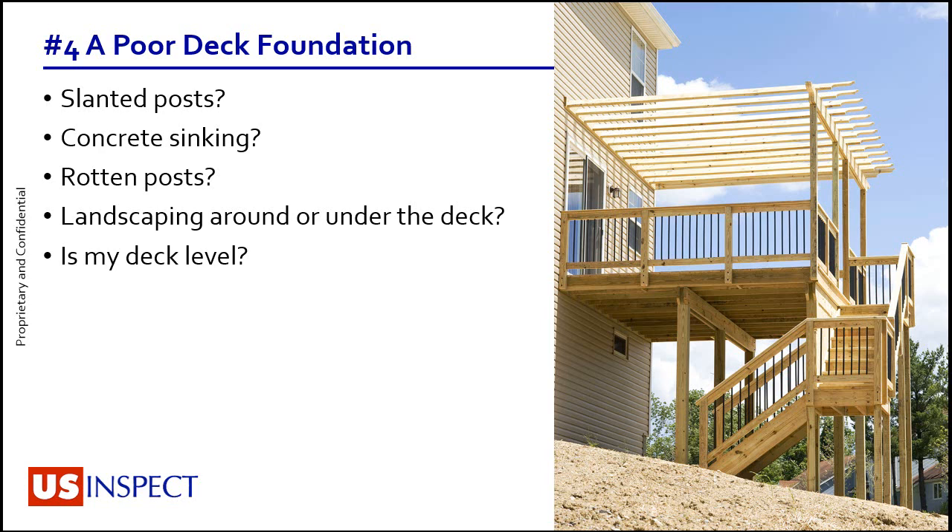Decks are pretty simple structures — basically an exterior version of what's going on inside the house. Having proper footings for the posts to rest on and making sure the joists are level is key. A side note: the human eye is capable of discerning one thirty-second of an inch of displacement in a board that's 16 feet long. So if you look across a board and see it dipping or sagging, trust yourself — you're probably right, and it needs to be shored up or repaired. That's something you can advise your clients about as well.